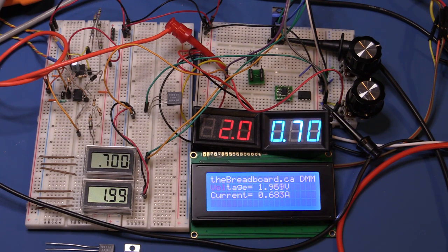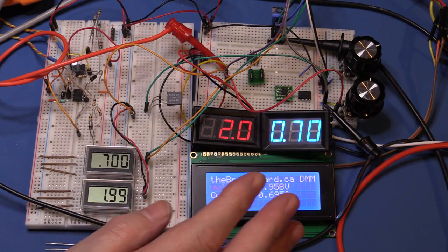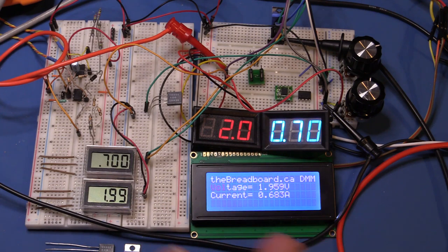The way to improve the current measurement is to add a small amplifier before the Arduino's ADC, or change the voltage reference to 1.1 volts — though that would require rescaling the sense resistors to avoid overloading the ADC input. That could be done with Vishay precision resistor dividers or standard precision resistors. So how does this compare to a quality digital panel meter? We've got 2.0 volts and 700 milliamps showing.